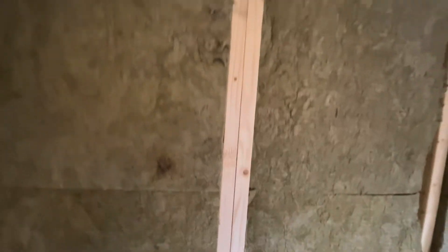That's all the base plates of the building sealed up now with the CT1 sealant. What we're actually going to do is put some more silicone on these joins here, so wherever we've got a panel joined together, we're going to just run some basic silicone up those joints just to keep it nice and tight.